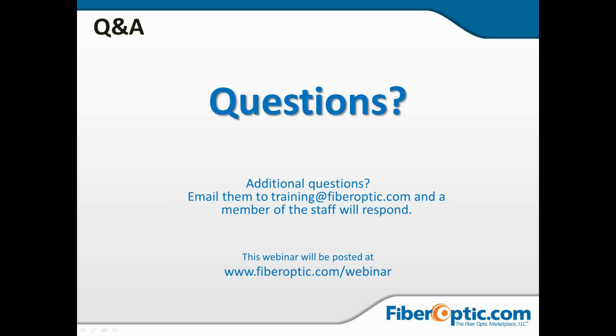So let's see. Someone here has had problems with splicing when taking a splicer from a warm temperature inside the vehicle or building to an outside where it's very cold. And the question is the best way to transition the splicer and cleaver to extreme temperature changes. The only good answer to that is time. Take it out and let it cool off or let it warm up.